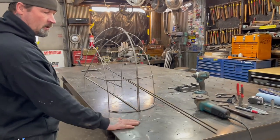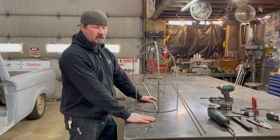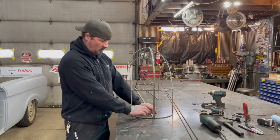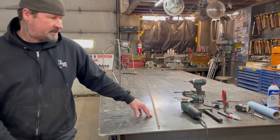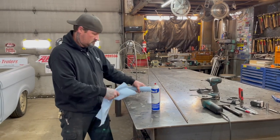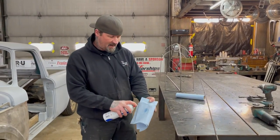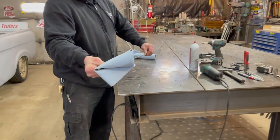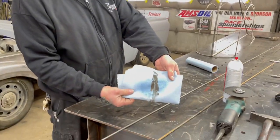You want a nice flat surface to start on, like a welding table. For guys and girls that don't have a lot of money and are starting from scratch, you could use a wood table — it doesn't matter. What I'm going to do is weld or clamp this to my table so I can start building these pieces. The next step is I'll take a brake cleaner or acetone and wipe these down. These come with an oil from the factory, and you want to get that oil off so when you go to weld, it's nice and clean and doesn't contaminate the weld.